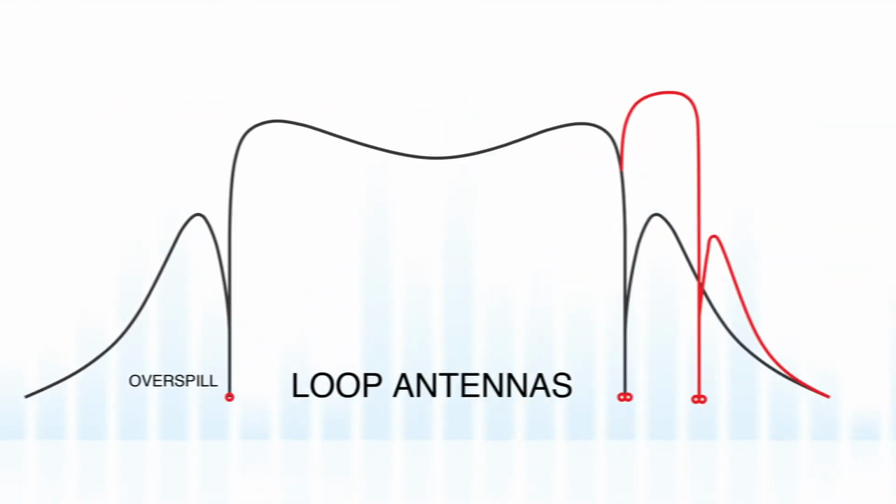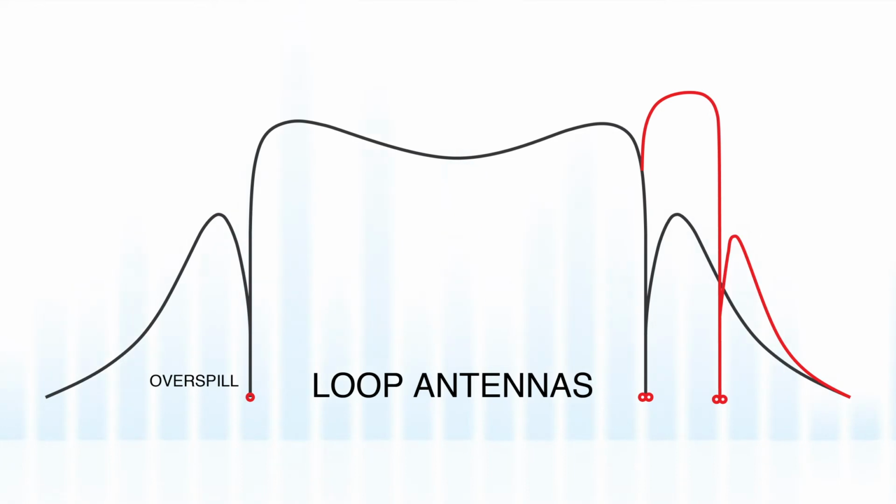Signal reducing loops were designed to confine the loop signal and keep it from bleeding over into adjacent areas, although this technique has questionable results. The idea is to reduce the spill by creating a signal reducing barrier along one or more sides of the loop. This is accomplished by reducing the size of the primary loop and adding a smaller 2-turn loop on the side that the reduced overspill is desired.